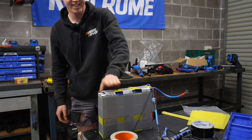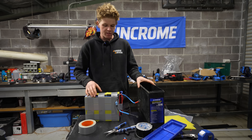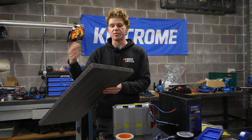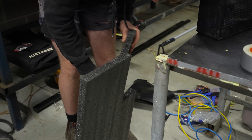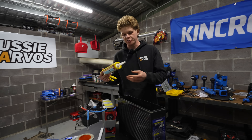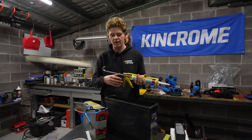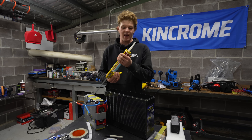The battery is all packaged and pretty much ready to drop into its case. Because the pack is a lot smaller than the casing, we need something to pack it out so it can't move or jiggle around inside. We've got some high-density solid foam from some spare packaging, and this will work really well — easy to cut, stackable to get the right thickness, so the battery cannot move in any direction once packaged up. I'm also going to use adhesive to glue the battery to the bottom of the casing, and the same sealant to seal the lid when we put it all back together, so fingers crossed it'll be fully waterproof.